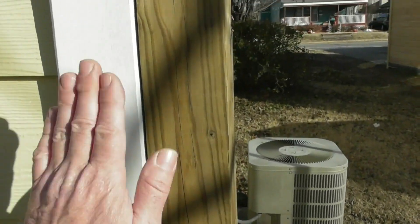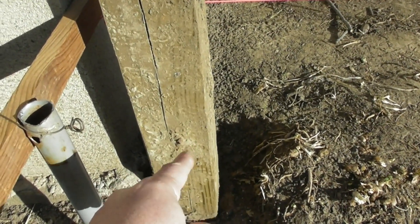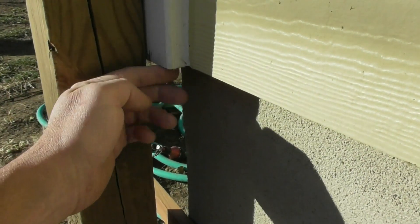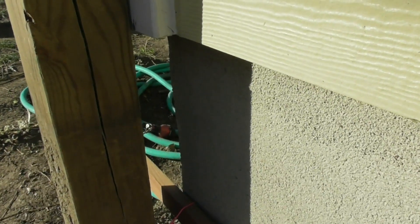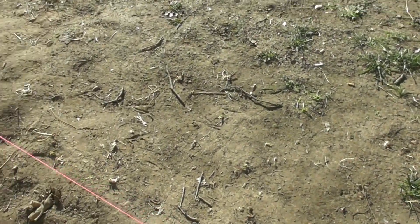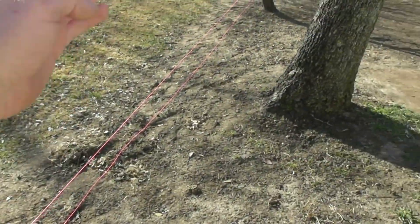This is the way I've elected to do this corner — I'm just going to come to the edge of my trim right here and run straight down. There was a concrete plug in here with a post so I don't think I'll run into my fitting. But I've got this gap I'm left with. On this side the stringers will tie in and end up just at the edge of this trim. When I put the picket on, I'll simply scribe around this and butt it up to the house. If it's too atrocious looking on the opposite side, I may put some blocking in there and just put a piece of picket — and then the picket itself will just lap over this trim and ride up the siding right there. I'm going to start with the corner posts — I'm on crunch time, so I'm going to start punching holes, setting the corners, laying everything out, and moving on.